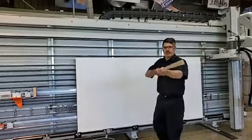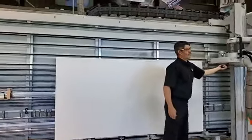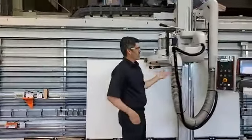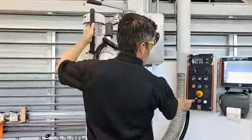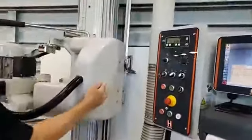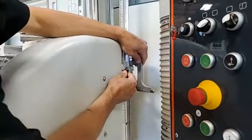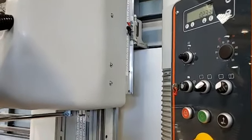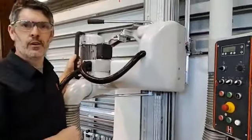There's also a distance cam stick, so you can make sure you're six feet away. Now the next rip we want to do — let's say for drawer boxes or something to this effect — let's say 8 inches. So if you have a 1254 or 1255, you have a repeatable stop on the side. Christian can get a look at this stop here. So I can set the scale by measurement. Let's say 8 inches. I'll bring it up and swing it out, bring it down to the top of the panel, and lock the machine. Now the machine is set for 8 inches from the top of the panel, so I can get an 8-inch rip. Now we'll cut.